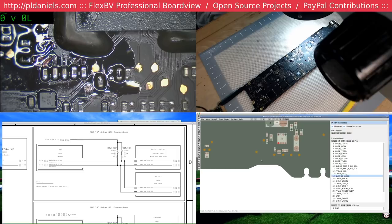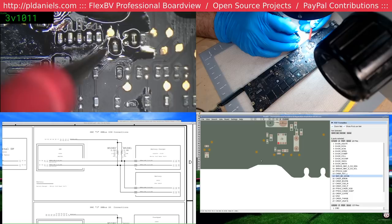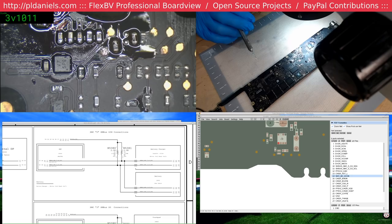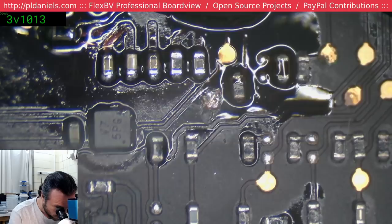So the SMC might actually be okay, but like I said, I'm thinking it might be the trace on that pad. So we replace that resistor, but you'll see that the via is actually over here, and then there's this. Mind you, it feels like it's got copper there, but let's see. I don't know, I don't trust it. I've got a feeling that if I scrape back this via cap top, it actually isn't making contact.